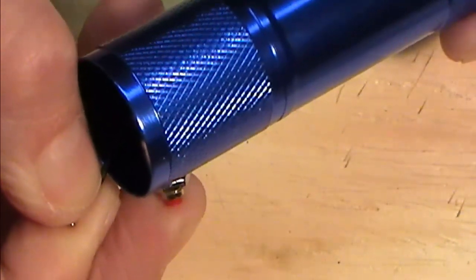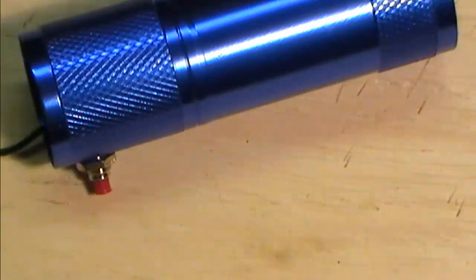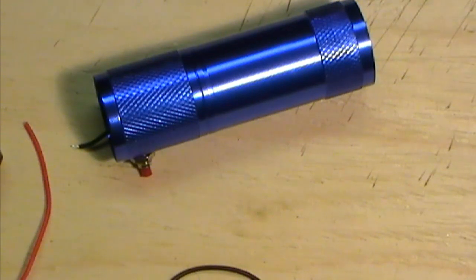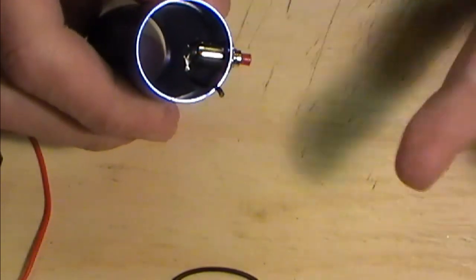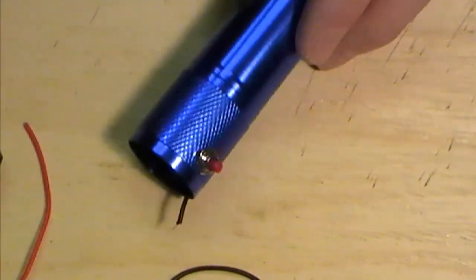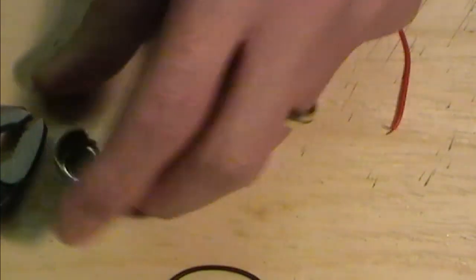I've got continuity. So it's pretty much like we were talking about when we were doing the drawings the other day, and we were talking about carrying the current via the body, and all we're doing is really interrupting that before it hits the atomizer end. So literally, we're earthing, or our switch is, one of the tabs is soldered to itself, so the switch, when you hit that, interrupts either the pos or the neg up to the atty connection. Simply our next stage is going to be to bring in our chopped around atty connector that we've got.